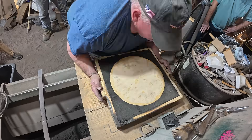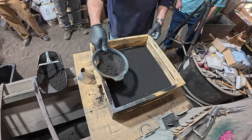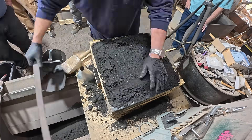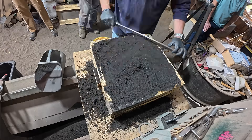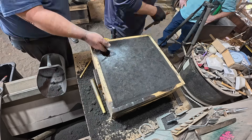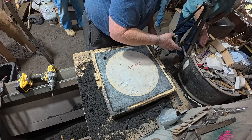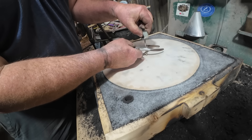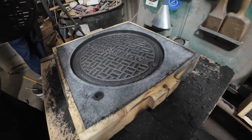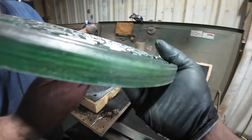We flip it over and there is the CNC object I just made — I put the date on it. Now we're doing the other side of what would be the mold. We sand it so that they don't stick together, and then more green sand — it's called green sand even though it does look black. I'm tamping it down, compacting it, making sure it stays together. This is going to be a riser and a fill — that's where the fill will go. Clark is just tapping it and pulling out the mold, and there's the CNC mold from New York. We had a perfect casting — the very first one we made came out really good. The second one didn't come out as great, but you'll see that in just a couple of minutes.